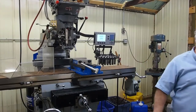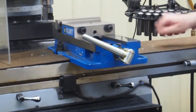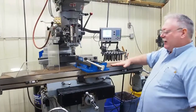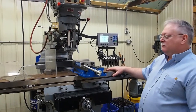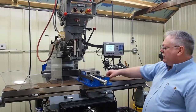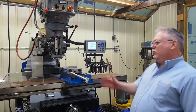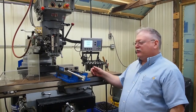You'll notice that the chips are flying onto this tabletop — this is simple to clean. You can just take a brush and brush them right off. If you're careful with the air hose, you can give it a light blast. It doesn't take much at all, and now your tabletop has cleared the chips. Your tabletop is protected by the guards. This setup works really nice — it'll eliminate a lot of time you'd otherwise spend cleaning chips out of your T-slots. The guarding will also protect you from having chips hit you in the face or on the arms. I've been burned numerous times in the past when I wasn't using chip guards. Anybody that has done much milling knows exactly what I'm talking about.